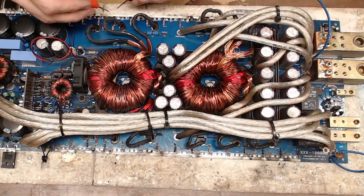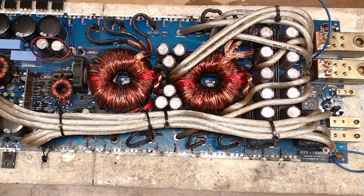Yeah, those gate resistors looking good. They do have some zeners here too, so that's the gate drive. Oh, and this green LED is about ready to fall off. Unfortunate. The gate drive, it'll tell me a lot when I power up the gate drive. The amplitude of the gate drive signal will tell me if these zeners are still good to go.